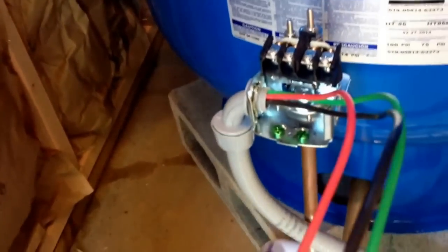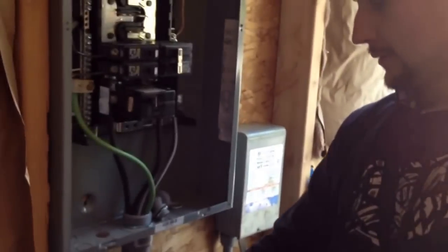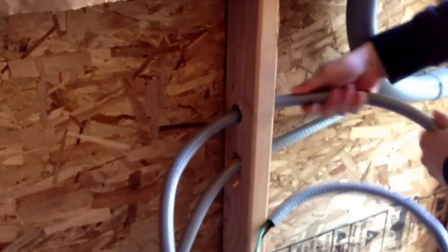Plumbing is done. We are working on the wiring. You can see the pressure switch is there. We have got our leads that come from the control box — the black, yellow, and red come from the well head. L2 and L1 will come from the pressure switch, which will be fed from the power panel. We had to run to the hardware store to pick up a new lead to connect that up. We are now installing the last electrical pigtail — the pressure switch connection from the electrical panel.